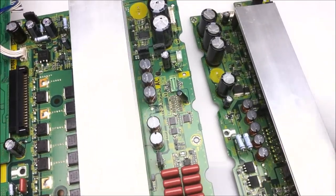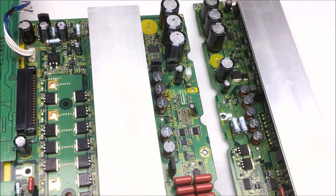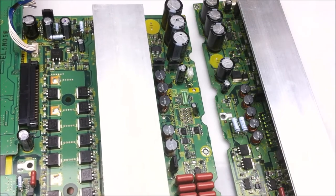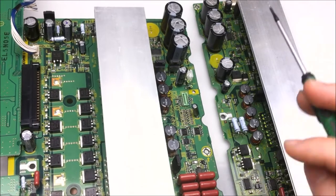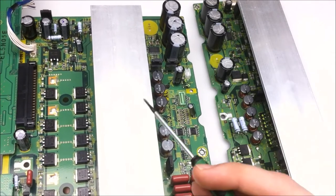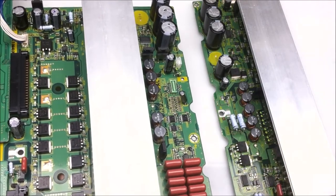I also believe that this operates on AC, not DC, so the vacuum fluorescent analogy isn't exactly correct, but the control wires going vertically won't really care. Instead of using free electrons that hit a fluorescent material, what they do is they generate a plasma, and it's a high frequency AC plasma, and I believe that because of these inductors and switching components. So if this board is negative, then this board is positive, and if this board is negative, then this board is positive, and they switch back and forth to create the plasma.